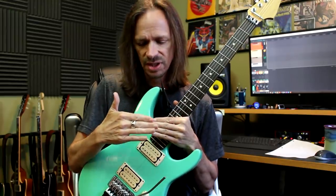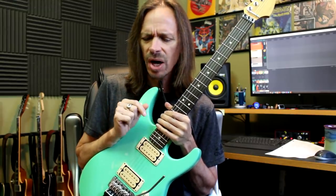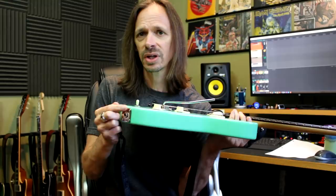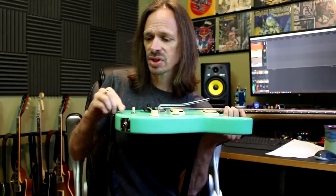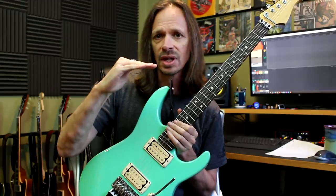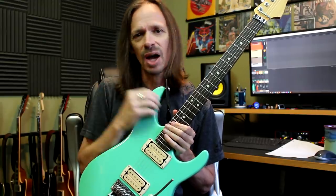The half inch is for the deep panel socket, and I would only order that if you have to. That leaves three-quarter and seven-eighths. In theory, you want the three-quarter inch if you have a body with a large edge radius, and the seven-eighths if you have a body with a small edge radius. Personally, I always just opt for the seven-eighths. The three-quarter can get a little tight — you need enough room for the jack to expand to accept the cable — so I always go with seven-eighths.